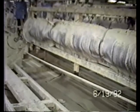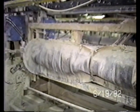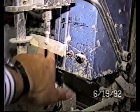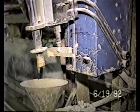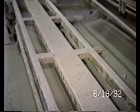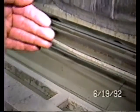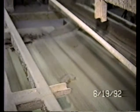See the airbag arrangement and how the bags are strapped up against the one portion of the frame. You can also see this sensor, which determines the point at which the filler neck stops penetrating down into the mold. The canvas or rubber type of conveyor along the bottom is very visible here. It runs from the extreme outside all the way across to the opposite side. It's serving two sides of the line. And you can see the belt slightly radius to keep the material in the center.